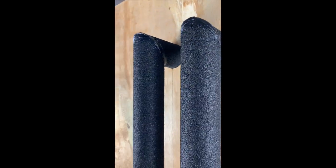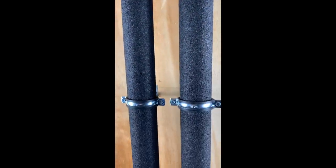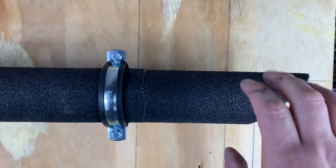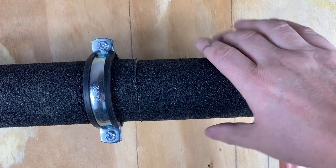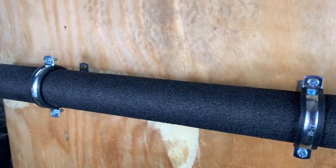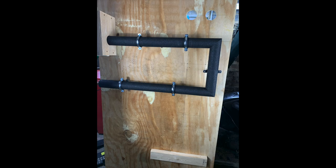This is an example of two vertical drops to the air source heat pump. This is an example of some horizontal pipework that has been installed, and shows you how easy it is to mitre and cut the insulation to any angle.